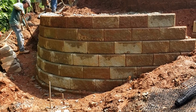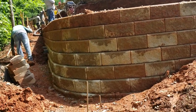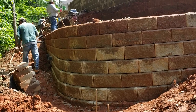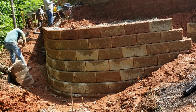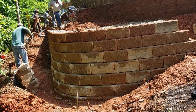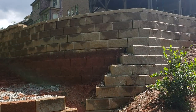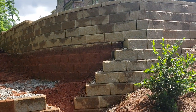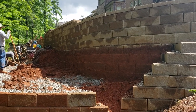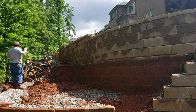So here's the wall we're building — you can already tell from the lines, there are no gaps in it. It's really crucial on these walls to get that first row level, because the higher up you go — third, fourth, fifth row — the more pronounced the problem becomes if you're even just a little uneven on that first row. Here's the wall the other company built — you can already see gaps, and the lines are crooked.